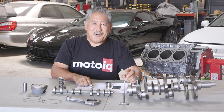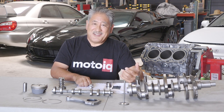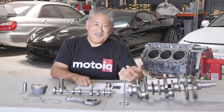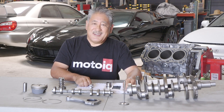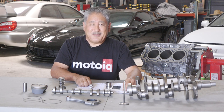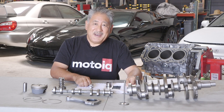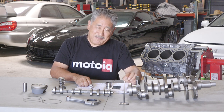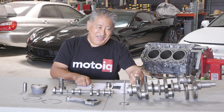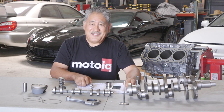The surface is also more wear-resistant. Typical wear surfaces that slide against each other — like camshafts, piston rings, piston skirts, and cylinder walls — you can usually get double the life out of a WPC-treated surface, largely because of this fine grain structure. WPC also produces a really even surface. The process knocks down all the little asperities and defects from machining processes, and it's even better than polishing.